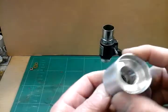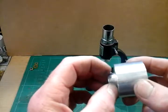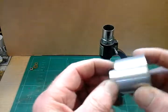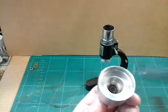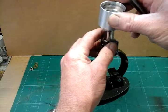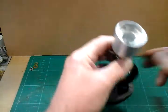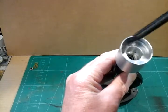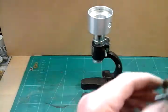I've been on my Myford lathe and I've made the other top housing. It's just a longer version of the bottom housing and a bit bigger diameter. I've pressed the bearing into this housing like I did for the bottom one, and then it's a nice tight fit into the microscope head. And then this top diameter is where my motor will fit. I'll just briefly show you how the motor fits, and then we'll deal with the motor a bit later on.